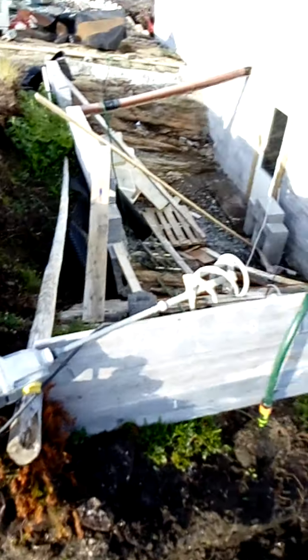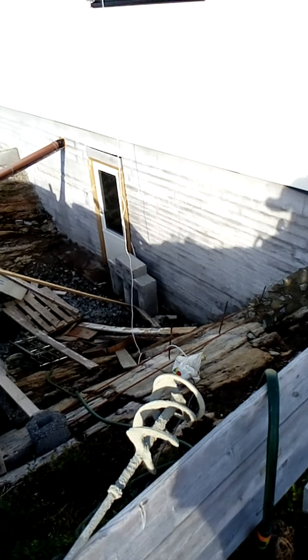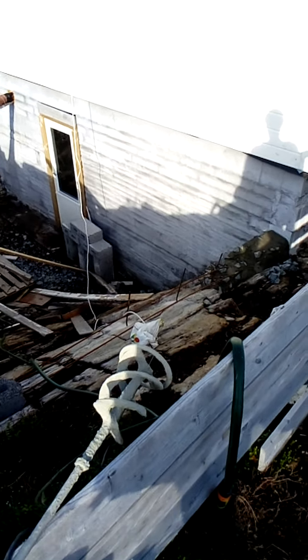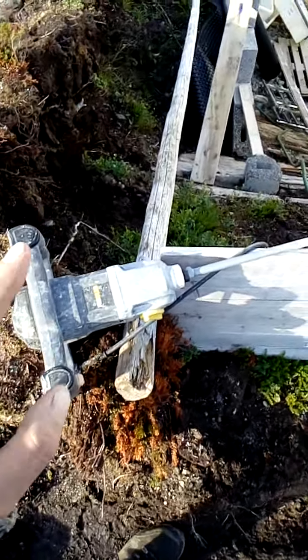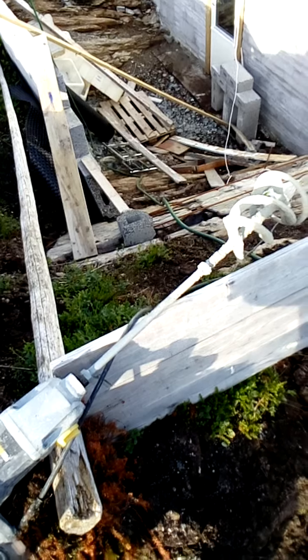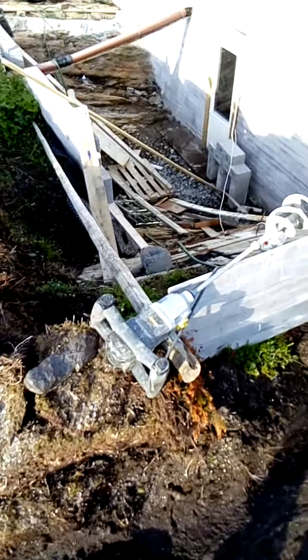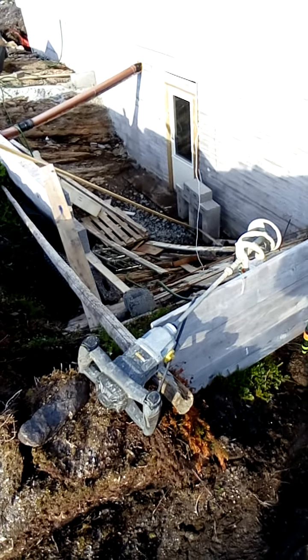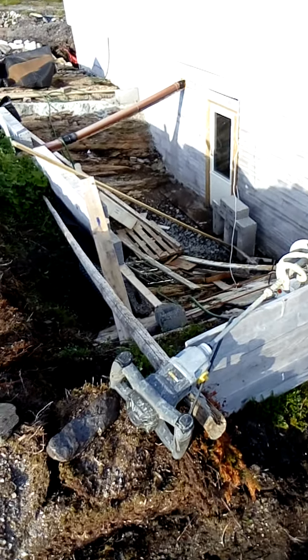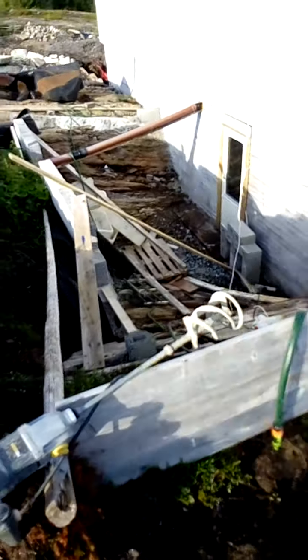This is a hand mixer — I make small portions at a time. If I were doing this the conventional way, I'd set up boards or planks to build a mold and just pour it in, which would be a lot quicker. It would also be nice to have something that mixes bigger amounts, since this one takes about one bag of concrete. I can use a bigger bucket and take two bags, but anything more becomes cumbersome. I'm going about this way because I want it to be stronger and it saves me concrete, which saves money.